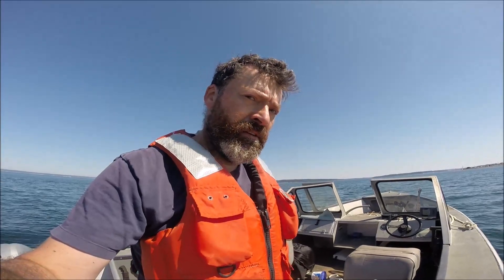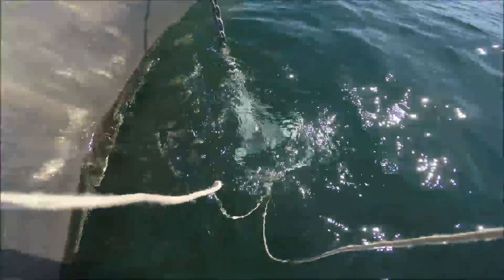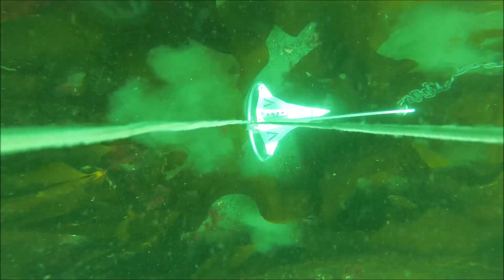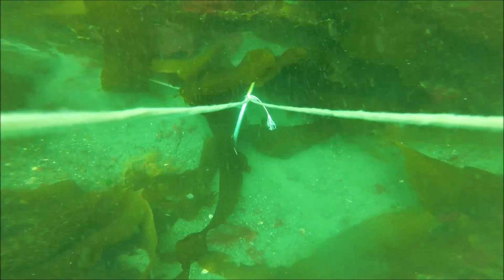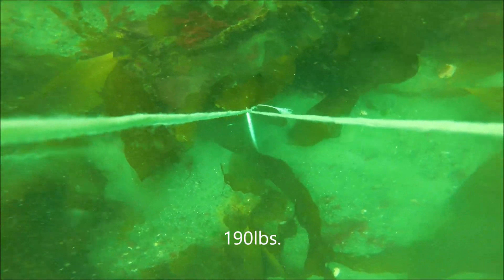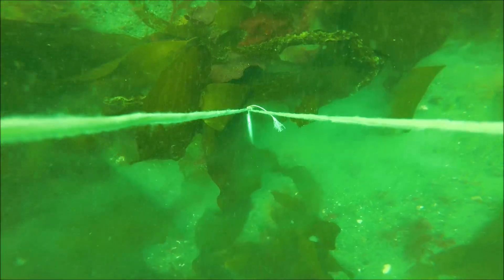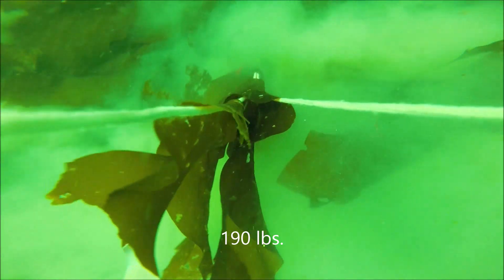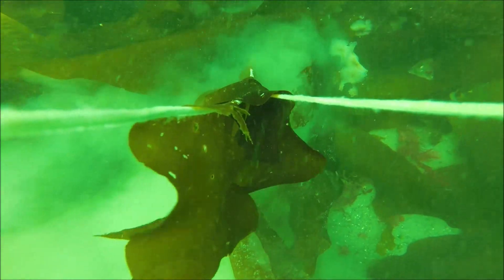Viking 7, sand and gravel, 5 to 1 scope. After lunch, we've moved over to my sand and gravel site. This anchor has landed just perfectly, not on a leaf of seaweed — fortunately, because there's a lot more seaweed than normal; it's mid-summer. The initial set was fine, but on the reset I added a little more power, the anchor started to drag, and it immediately collected a massive ball of weed. I dragged the anchor back and forth a few times and it wouldn't develop any holding power.